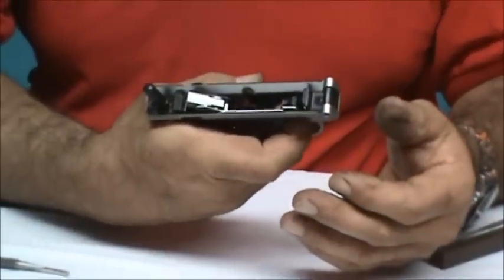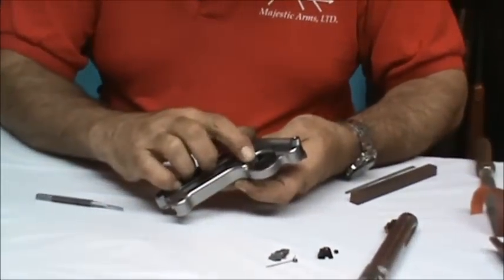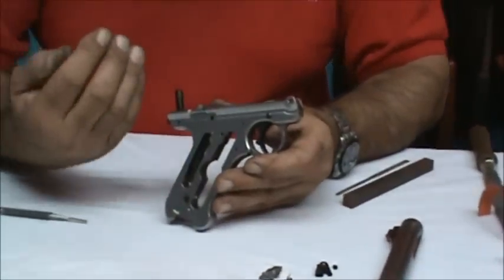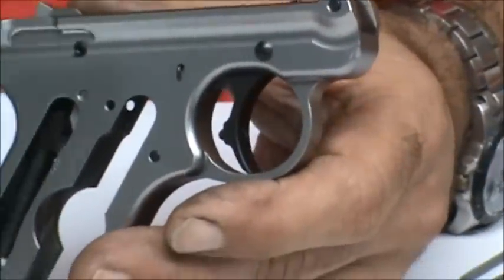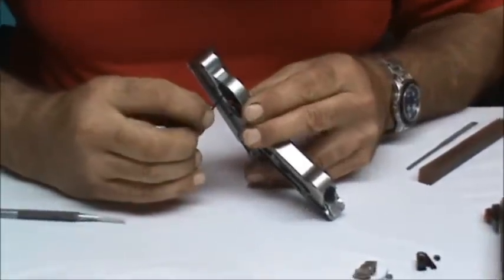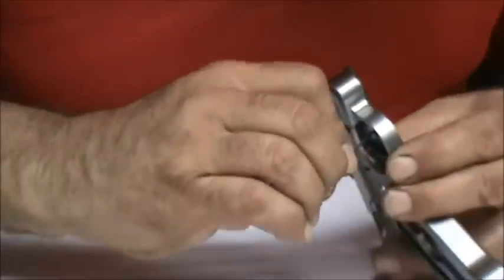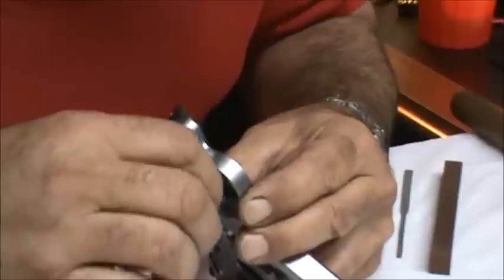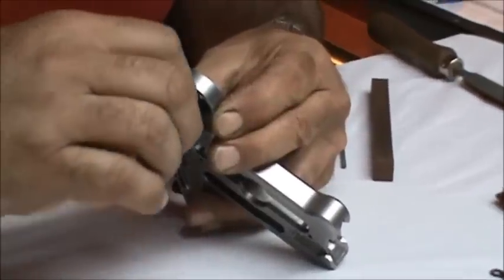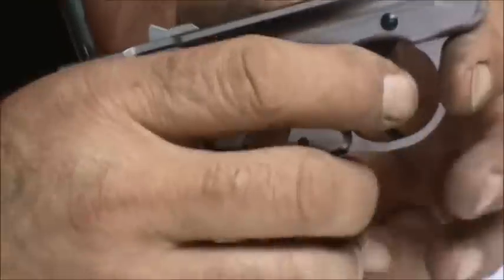At this point, lock your safety on, pull the trigger about ten times — nothing should happen; it should not dry fire. Turn your safety off and you're good. Now, last thing is your trigger has an over-travel adjustment screw. The whole idea is to allow the sear to move just far enough to release the hammer without the trigger continuing in its motion — it gives you a nice crisp feeling. That uses a 1/16th of an inch Allen key included in your kit. You can look inside and see how far the sear moves beyond the hammer. Often I'll set the whole gun up, then stop, take it apart, apply Loctite — you've got 20 minutes to work once you've applied it — reassemble it, set that, and set it aside for half an hour.